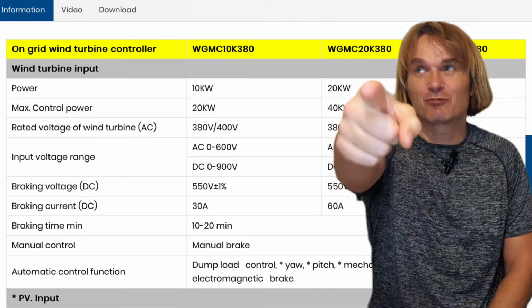Why can't we leave this turbine alone? Why do we have to turn it from the wind? Because of the tip to wind speed ratio. As was in previous videos, this is the constant ratio of the speed of the tip of the blade to the wind. And if the wind is like 50 miles per hour, this means if the tip speed ratio is 5, the tip is going 250 miles per hour, which is already very fast.